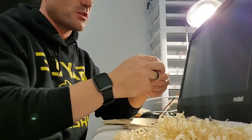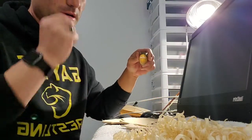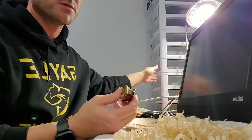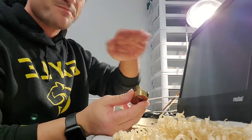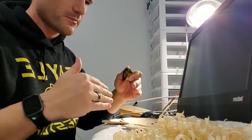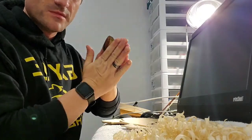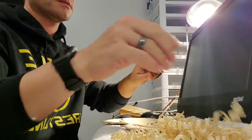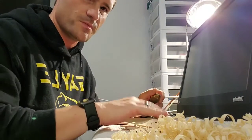If you can get your blade really sharp — now this one I have a fairly large gap because I'm trying to hog away a bunch of wood, but if I'm trying to really fine tune something, I'll take this blade out. I'll sharpen it on the sharpening stone in my tools over here, and then I'll try to get this opening as razor thin as I can get it, so I can slowly join two surfaces together.